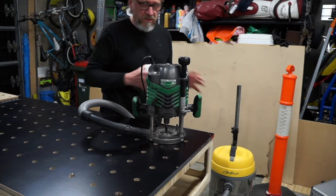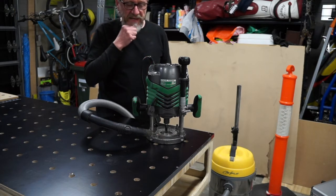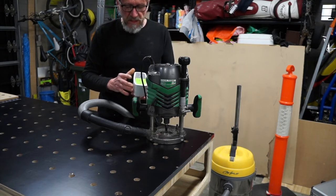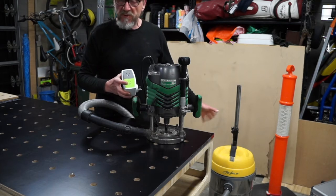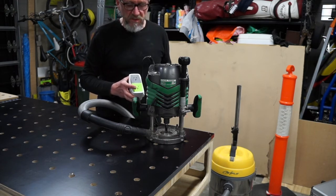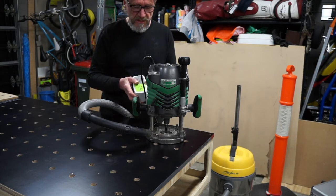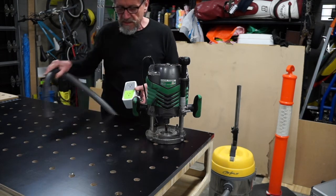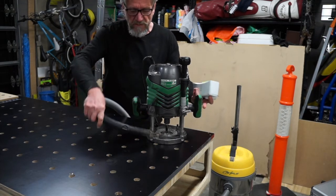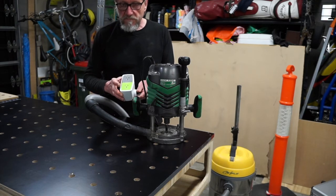So there's no need to manually manipulate the vacuum, turning it on and off. When you turn the tool off, it sends a signal and this device says we don't need the peripheral device on. It waits about 60 seconds before it turns it off, which is really handy for the vacuum because that 60 seconds allows me to unplug and do a little bit of a clean up for any residual that might be around, without having to turn the vacuum on and off.